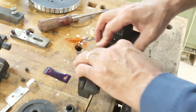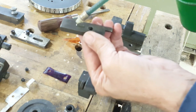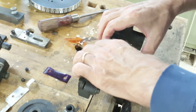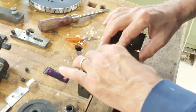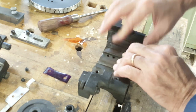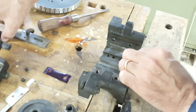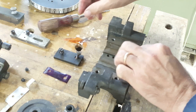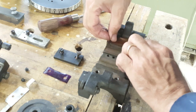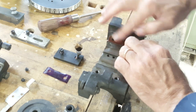I'm putting the slider in by compressing the two springs against these two lugs and pushing it down through here, and it has to be able to slide smoothly. In addition to all those parts there's a gib here which has some adjusting screws for its clearance. I'll oil its surface. The gib goes in here, and once the adjusting screws for the gib are in, they'll stop it from sliding back and forth. Now in order to stop this thing from popping up I'm going to put on the retainer plates — here's one of them, the smaller one which fits on the side that doesn't use the gib.